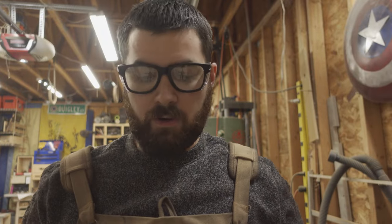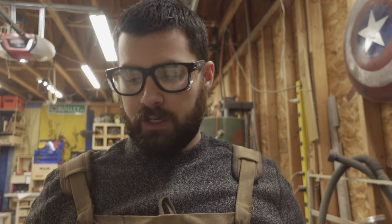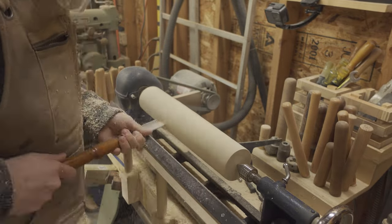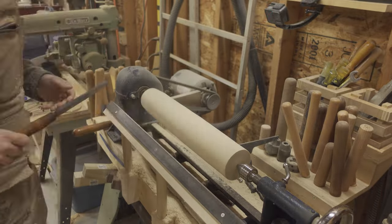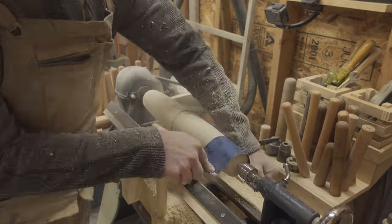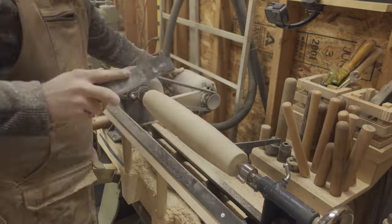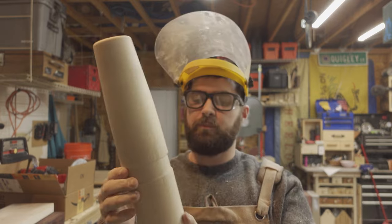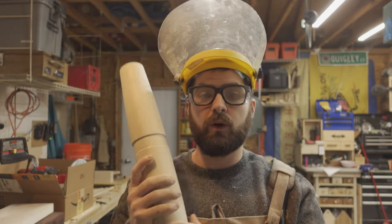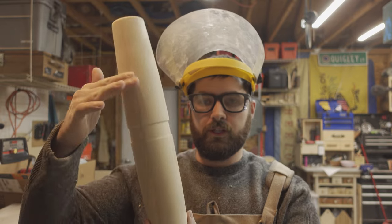Just like I did in the previous video, I have a caliper set to my center dimension and a caliper set to my end dimension and I'll just taper down to it. I'm going to be checking it constantly, getting this into round as quickly as possible, then tapering it slowly, setting my center line, all that stuff. There's another bowling pin done. I put the groove for the stripe a little bit deeper on this one — it might make it easier to tape it off when I go to paint it. This one will be painted, so obviously this will be white with a red stripe.